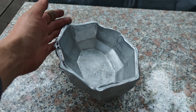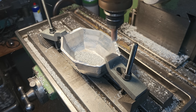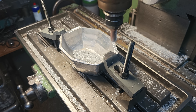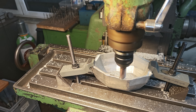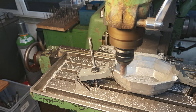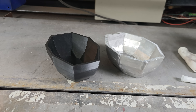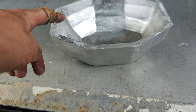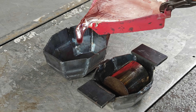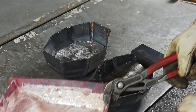As expected, the top part of the casting is very uneven, but I knew that would happen — that's why the mold is actually two centimeters or so taller than the actual casting I want to make. To create a nice even top side, the milling machine is then employed once again. And here you can see the first somewhat successful casting right next to the 3D printed pattern. Once I have a belt sander, I will try to grind the outside surfaces down to get a more defined geometry. What I really have to work on is a better method to quickly and precisely insert the smaller mold into the larger one — but other than that, I think this could work.